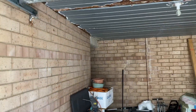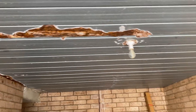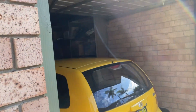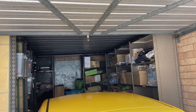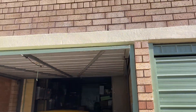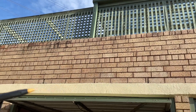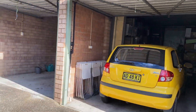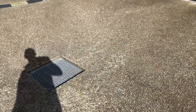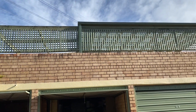We've looked into the garages. There's prior evidence of water leaks and rust stains to the span deck, although there are no current water leaks to the garages reported to unit 14, or to my knowledge unit 13 next door. It would be beneficial if that downpipe was redirected along the slab edge, dropped down between the two garages and discharged onto the pebble crete, where it would flow across to the stormwater pit. That would take a lot of load off the tiles.